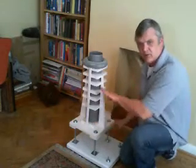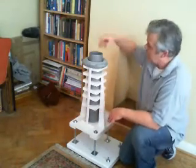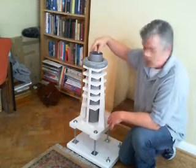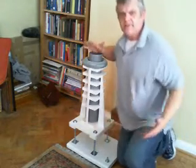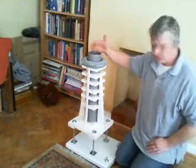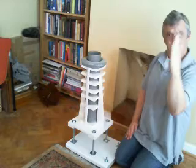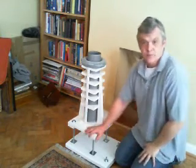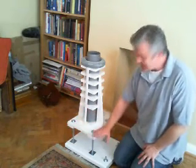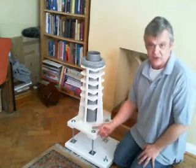The whole point of this section is that as you raise and lower these bolts, this section is going to tilt in these two directions. When we put the drum on this section with the belt in between, they're not going to be perfectly lined up — you'll do your best by dropping a plumb bob and that kind of thing. Being able to adjust and tilt the tower in those directions will help you line up the belt. This forms a tilt correction mechanism — an alignment system.